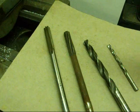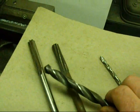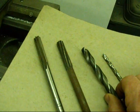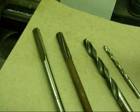You're sizing the hole. Also a reamer hopefully brings the hole into true round. A hole may not be all that round when you drill it, if you're able to measure it accurately like they would at Caterpillar or someplace like that.